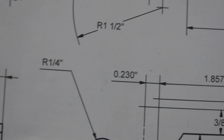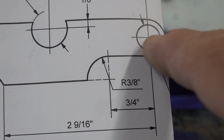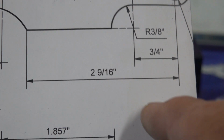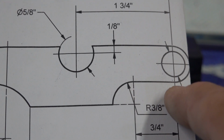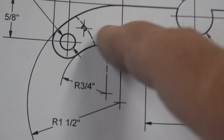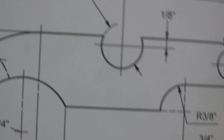So yeah, that's what I want to do, is clamp them together with that bolt and that bolt through. That's not going to be finally drilled. I'm just going to drill the hole that size through and bolt them together, try and get it so that I can still get to machine this and machine this radius. So I'll do that in the milling machine on a vise, and then that radius and these two and this final one, they'll all be done on the rotary table because I can mark that up. So that's what we're on with.